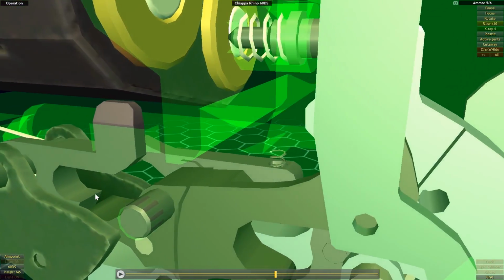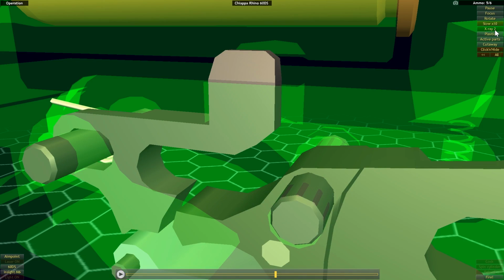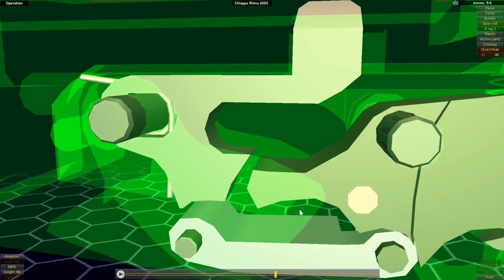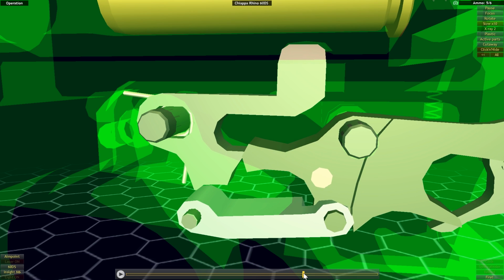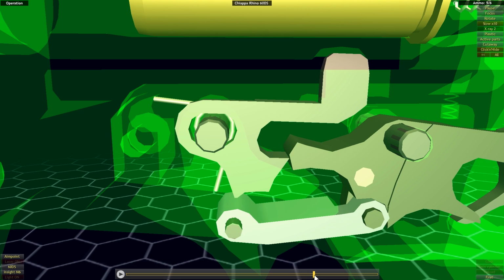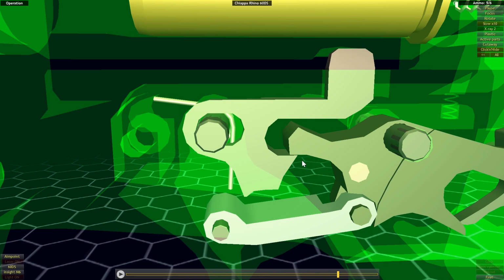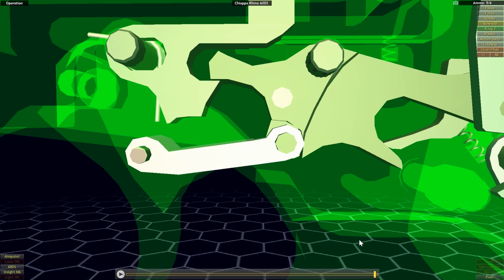just like with the Smith & Wesson, we can see, and I'll go out in the x-ray just so we can see it a little bit better. You can see an elliptical cut here in the cylinder stop. So what's going to happen is, as the trigger assembly comes up, it's going to push inward on the cylinder stop, allowing the trigger assembly to come beyond this ledge here and over top it so that it can pull down on the cylinder stop yet again.